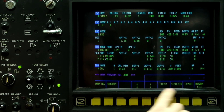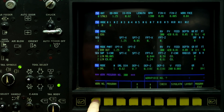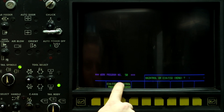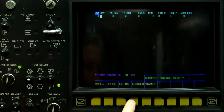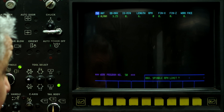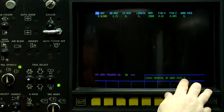We're going to push the left button, go to program, program file. We're going to select work number 50. Push work piece number 50, input. If this is a new program, push the program button. Mazatrol or EIA, we're going with Mazatrol. We're working with aluminum. Max outside diameter of work piece is 3.25, inside diameter is 0, work piece length is 6 inches. Max spindle limit, I'm going to set the G50 at 2,000 RPM. Finish allowance on X is 10 thousandths, and finish allowance on Z is 5 thousandths. Stock removal of work face is zero because the part is already faced off.